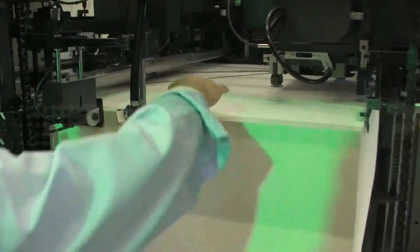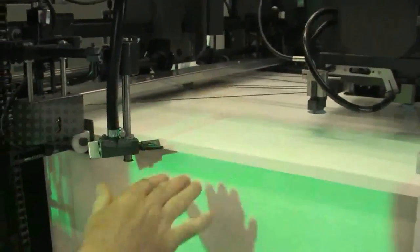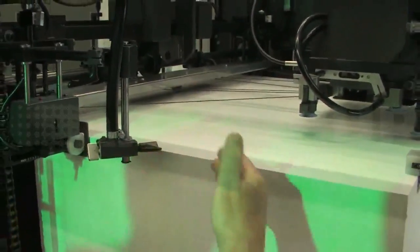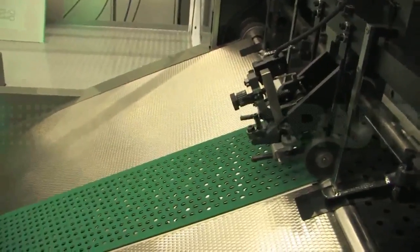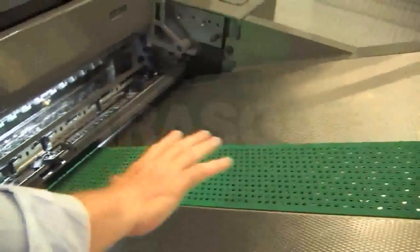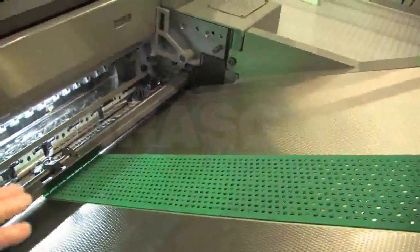Right, we also added these guide wires. These guide wires move according to the paper size, front to back or side to side. This allows us then to use less air to separate the sheets. The new feeder board has got a single belt. This single belt runs fast and slow. It slows down to 50% of the paper speed.